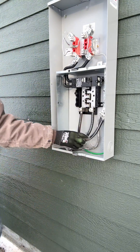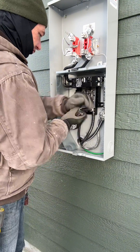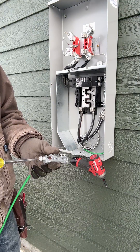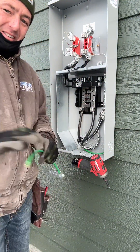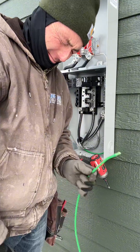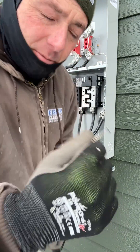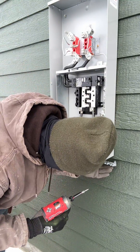For those wondering, I've never really done service loops — it's not something I ever come across where I think 'oh man, that's so nice to have.' The times it's too short I just splice onto it and finish the job. Also — stop using drywall screws outside. Use a stainless steel screw, a galvanized screw, or a coated screw instead.